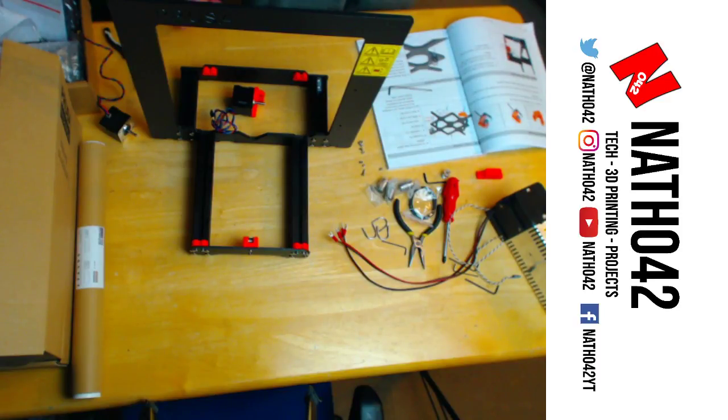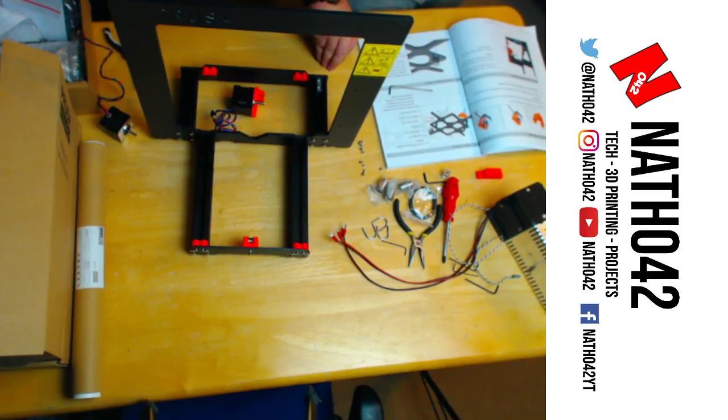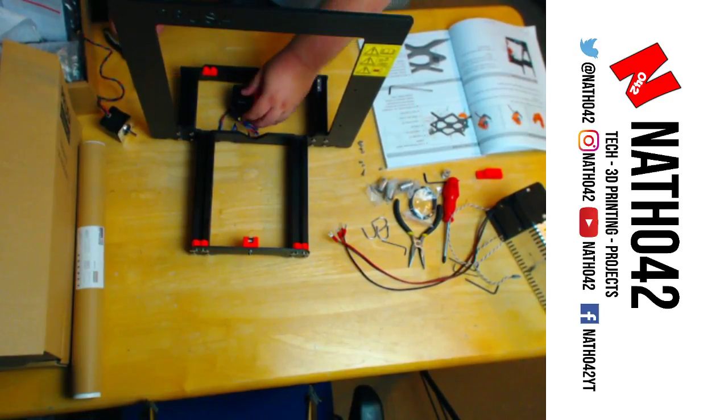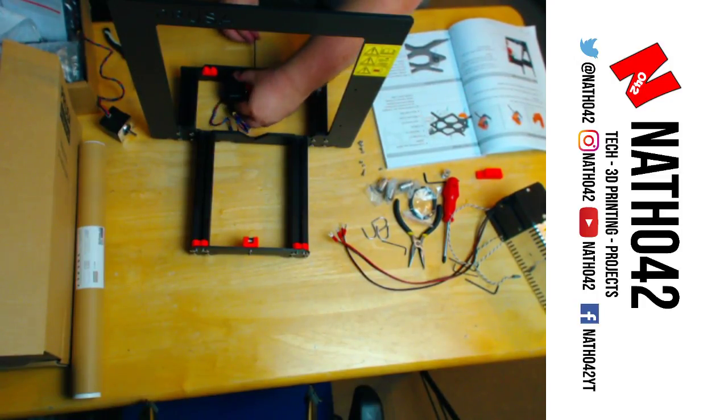B6. Take the Y motor holder and place it on the rear plate. Short extrusions. Ensure correct orientation, the motor shaft must be facing towards the PSU holders. Yep, so that's good. Secure Y motor holder with 2 screws, M3 10s. I always remember 10s because they're about a centimetre long. Because that's what the 10 means, it's 10 millimeters, I think. Yeah, I mean, you probably knew that, but there we go.